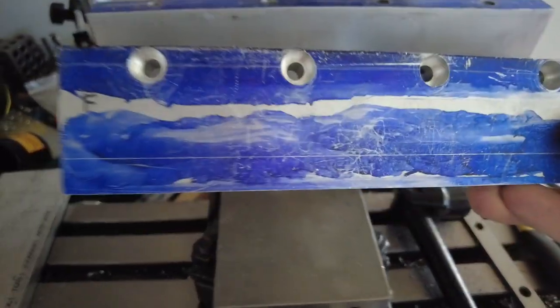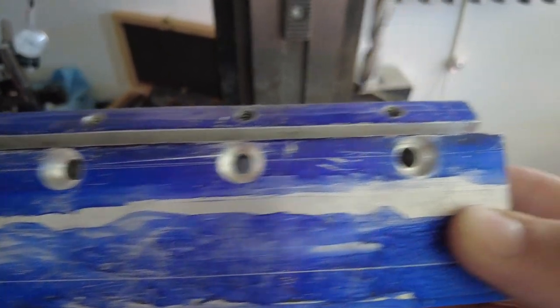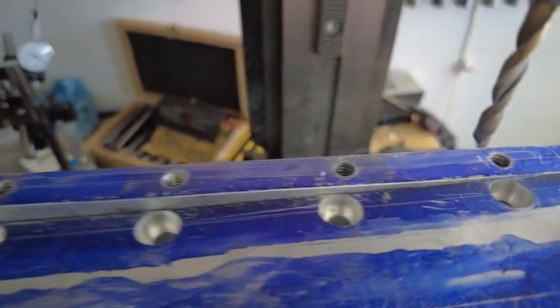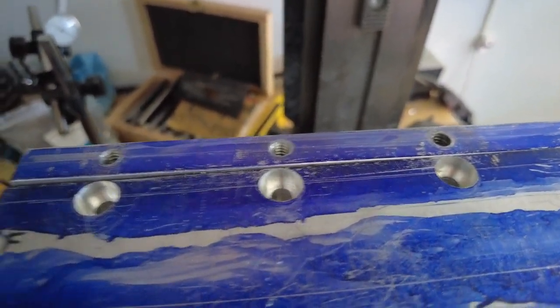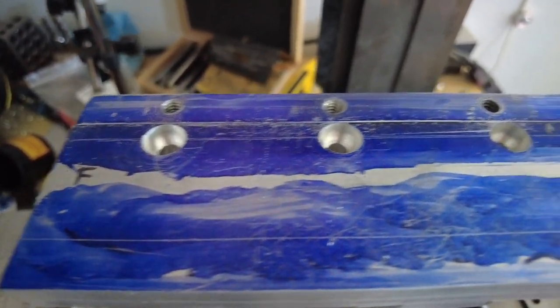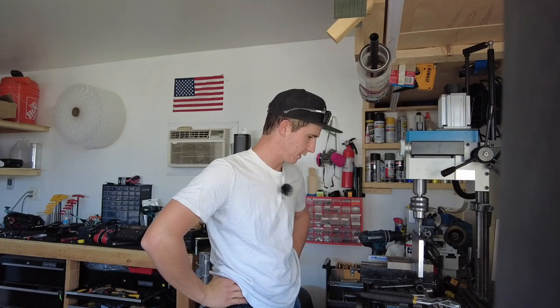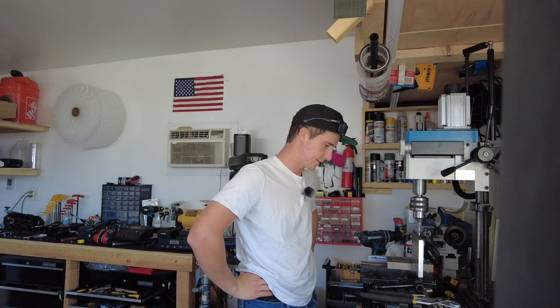And then when I go to this part, I do the same thing. I try and get as close to 17 as possible for the first one, and then I go 30, 30, 30. So then when you line it all up, it should be perfect, and it is, you know, within a couple thousandths of an inch. So that was kind of satisfying to get right. I might do a little cleanup real quick and then finish the last of this clamp.